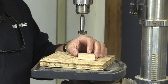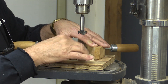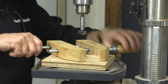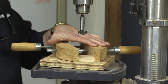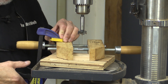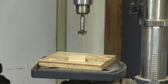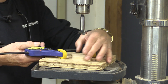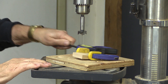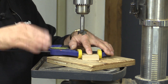One thing I like to do is use wood screws — they work super well. You can lay the piece flat, and I always have a backer board underneath anyway. You just tighten them down and now you've got a nice big piece of wood and a clamp to hold on to. If you think it's going to spin, you can even clamp this down to your table as well, which is even safer. You can also use one of these wide-area clamps — they give you lots of leverage. Clamping your piece down as much as you can is always the safest way to drill.